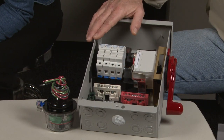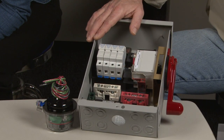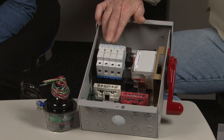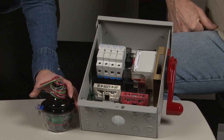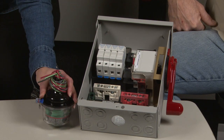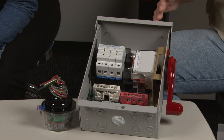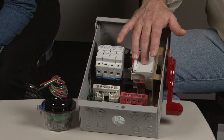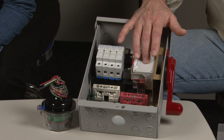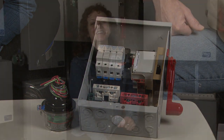John and I have the four-string deluxe version. It's the same as the basic, but it comes with 15 amp fuses and fuse holders, four half-inch strain reliefs, and the Midnight Solar SPD 600 surge arrestor. This deluxe is also fully connected to the birdhouse using a shunt trip circuit and a micro switch. The micro switch keeps track of the position of the birdhouse, so it knows if the combiner's been shut off. John and I are going to show you how to install the SPD surge arrestor on the MNPV4 deluxe model.